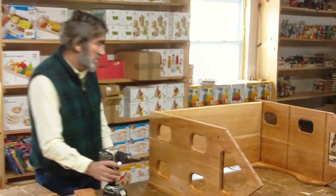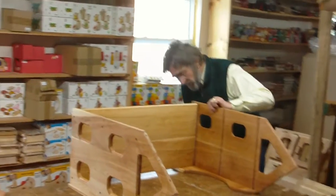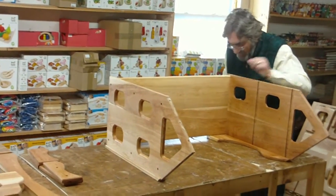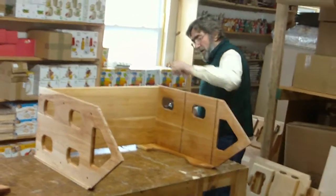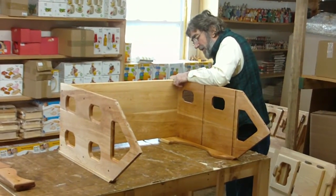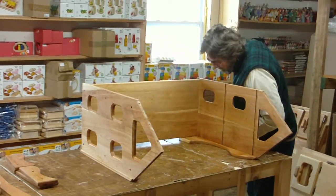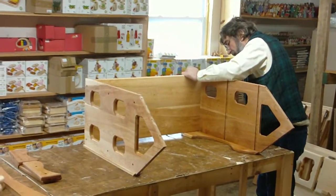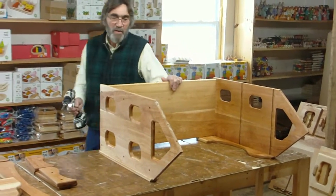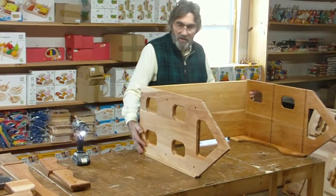Play kitchens, dollhouses, anything. Even if the piece of wood has a curl in it, which sometimes can happen after setting, you can most of the time take a curl out of a product by simply screwing in where the piece is hitting, and then lifting up underneath it and closing the gap. That's really an easy way to take care of it.